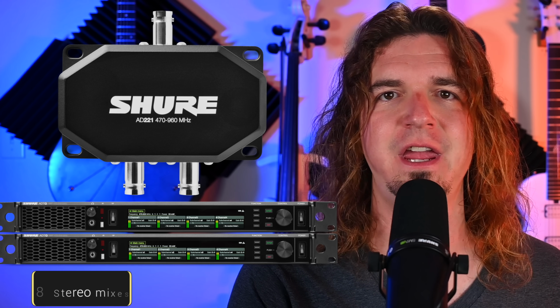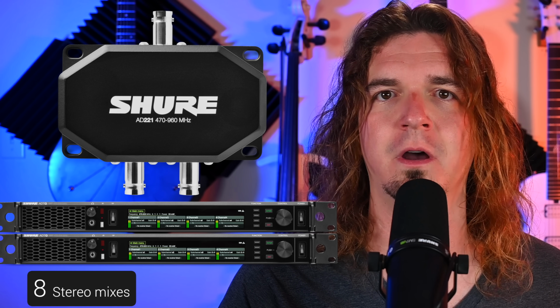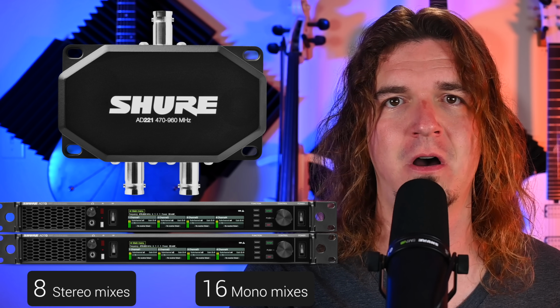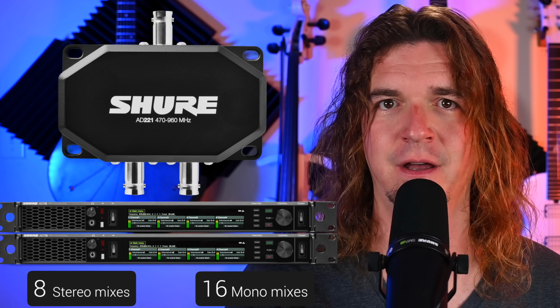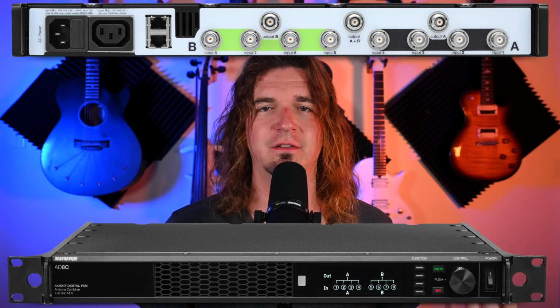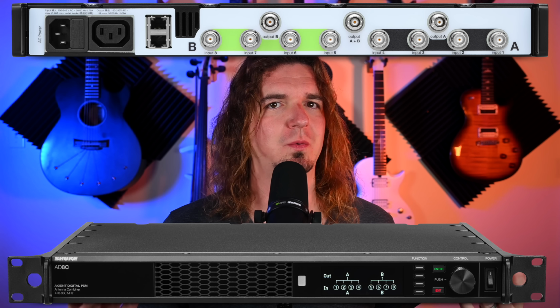Now you have 8 stereo wireless in-ear monitor systems or 16 mono channels, all running off of a single antenna. Pretty crazy stuff. Of course, if you do need to use more, they will have the active antenna combiner as well. But that's really cool, again, the antenna combining on this, that it's already combined the antenna for 4 of them, and you can passively combine to a total of 8 of them. Really crazy, really efficient, and not taking up a bunch of rack space.